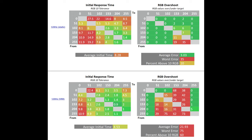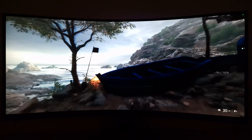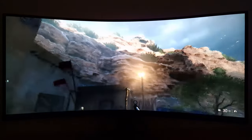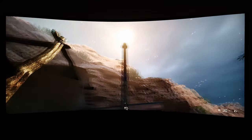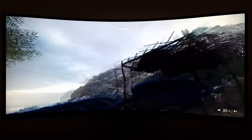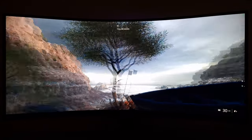With VRR at 120Hz on the Fastest setting, there's a lot of overshoot that will likely be quite annoying. The actual in-game look shows distinct weaknesses similar to the 180Hz experience. At 60fps/60Hz with the Fast setting, the connected feel is much worse than at high refresh rates, but VRR still eliminates tearing and stuttering. The VRR range is claimed at 48–180Hz; below 48Hz, LFC kicks in, though in practice I found the floor closer to 55Hz, sometimes as high as 57Hz with my RTX 3090, but LFC did work.